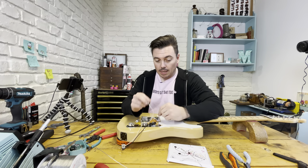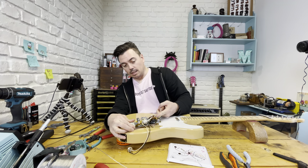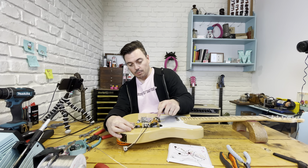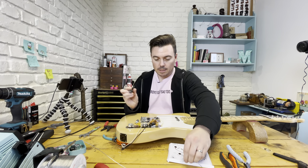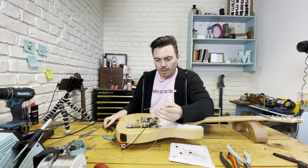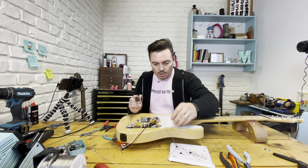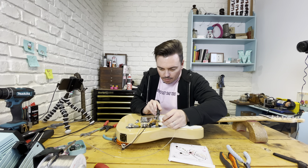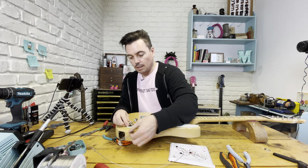So you've got the bridge hot and the neck hot. The neck hot goes into lug number one, and then the bridge hot goes into this one here where the live from the volume control is. Strip it off the end, tin it. This one is going to lug number one, the one furthest away from the volume control. I've tinned it, I'm just going to put the heat on and then put the wire on. Leave it for a second - all good. That should all be done.